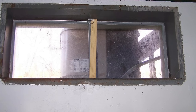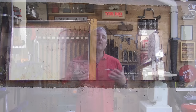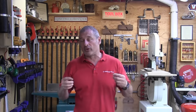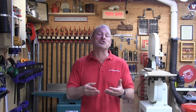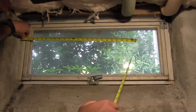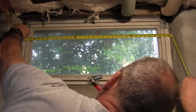You see that in concrete foundations and concrete block a lot. When measuring for a new window, consider whether you're removing the wood window or the metal frame, or if it's staying in place. For wood windows, I think it's best to just get rid of it all — take all the wood out, the jamb, everything. For replacement, you'll need to measure the width and the height of the actual window frame, not the sash. Measure the whole unit, and that's the size you want to order.